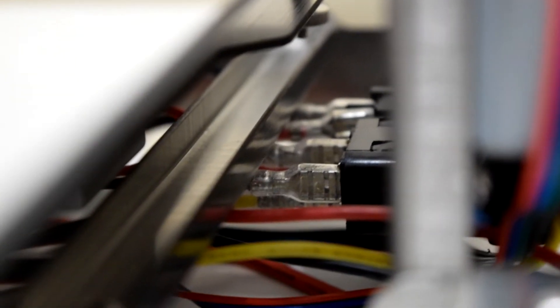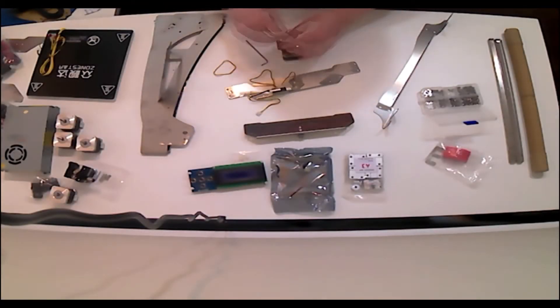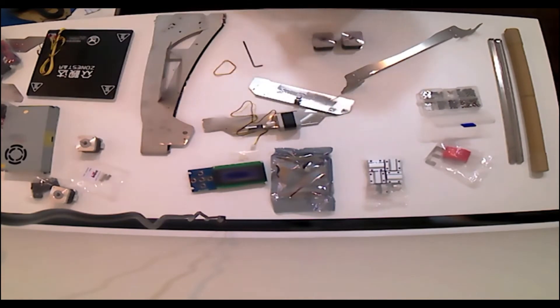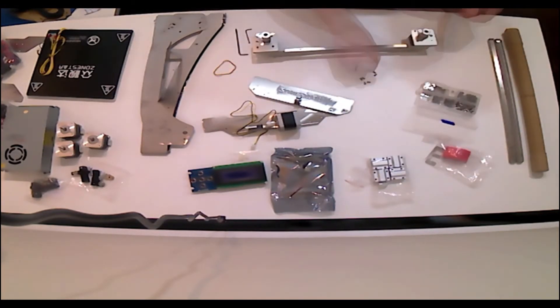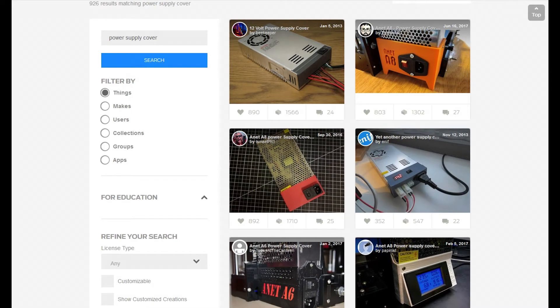There's only a small clear plastic boot as insulation in between. These kinds of boots are generally pretty easy to slip on and off of the connectors they cover, and the wires themselves were easy enough for me to strip with my fingernails. Not only that, but the printer itself is made entirely of bare metal, which is a disaster waiting to happen. This can be easily resolved by printing off a power supply cover that will cover the bottom of the power supply and house the wiring of the switch, moving the wires away from the bare metal of the frame. If you already own a 3D printer, I would recommend printing the power supply cover before even attempting to use this printer. But if this is your only 3D printer, just be very careful when wiring it up to make sure you don't electrocute yourself or start an electrical fire, and probably don't leave the printer unattended for any excessive amount of time. There are most likely already some power supply covers on Thingiverse that will work for this setup.